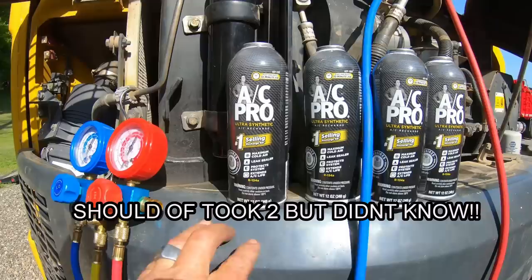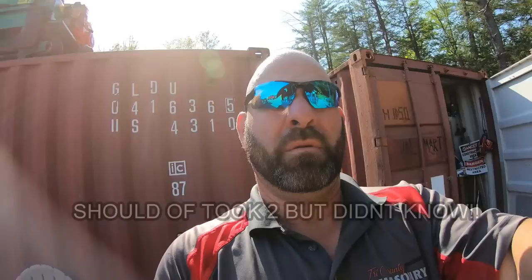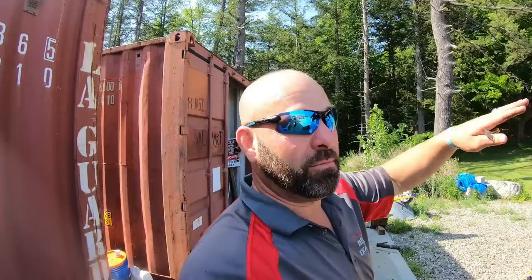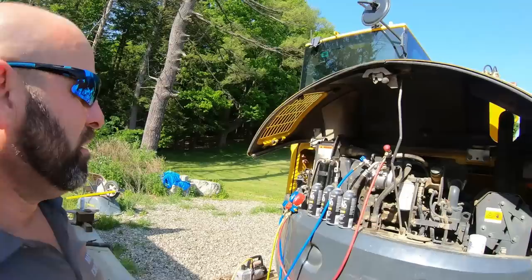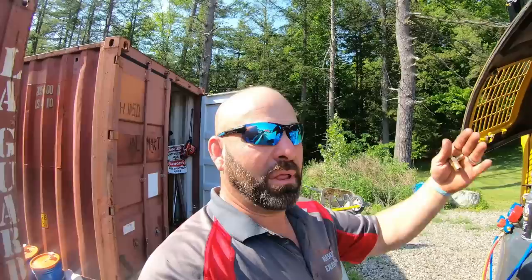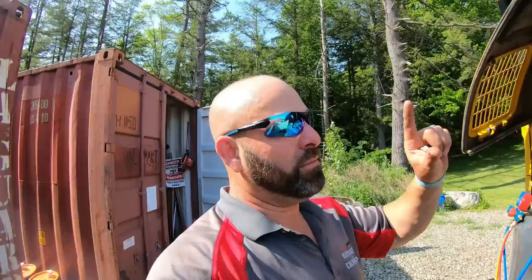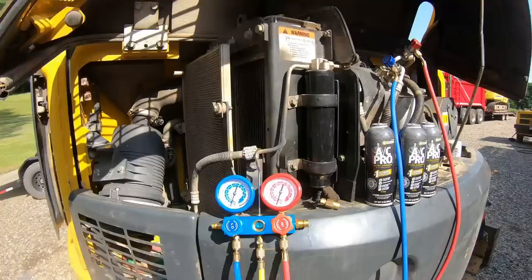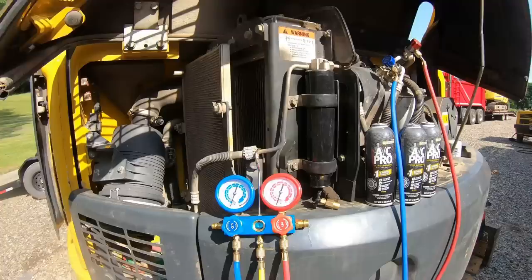We've got our four cans of refrigerant — 12 ounces, 16 ounces in a pound, so four cans gives you 48 ounces, which is your three pounds. I've been dealing with this since I owned this machine — just adding it in and then it would shut off with a code on the monitor, which is good on Komatsu because it wouldn't let me over-pressurize and blow a line or wreck the compressor. Running high pressures that fluctuate means a blockage. Going hot and cold means a blockage — which was the expansion valve.